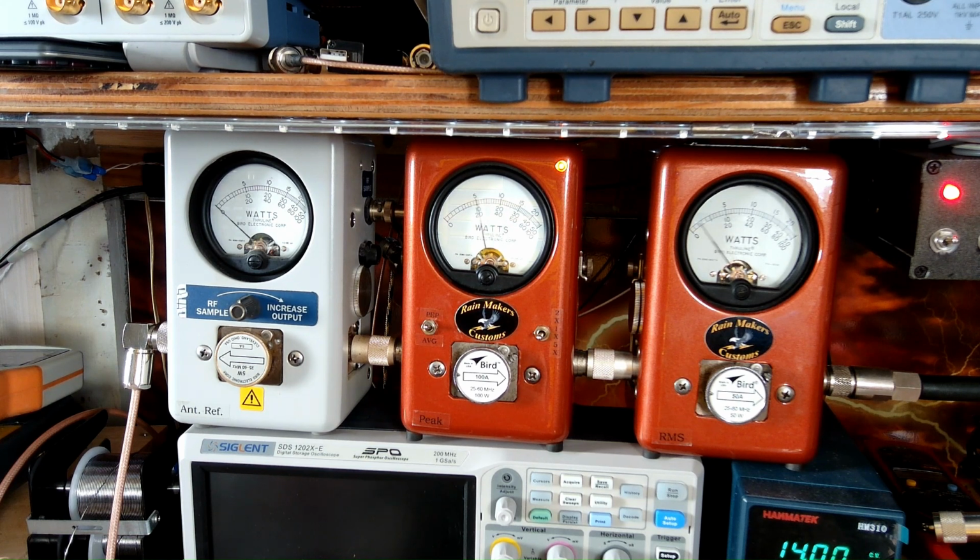So you're going to see we're right at that 38 to 40, and I'm not having to get into the microphone quite as much here in order to see the bigger numbers. You're still going to see about 58 on the PEP, but you're going to see that a little more consistent with the stock microphone, but that's not going to work sitting inside of a semi, because you'll have way too much background.